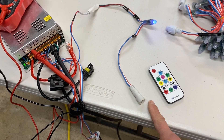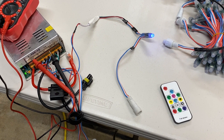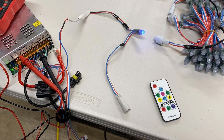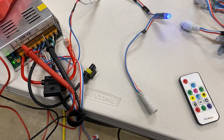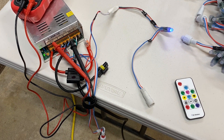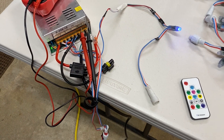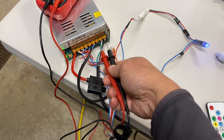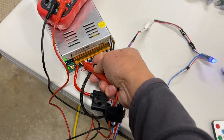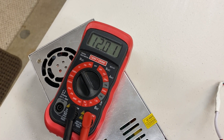Going to the end of a pigtail here. This little tester has 7 steps, simulating anywhere between 0 and 100%. Those steps are 14, 28, 43%, rounding, 57, 71, 85, and 100%. I'll show a table in a few minutes looking at how many pixels we can safely attach at different brightness levels so we don't blow a 5-amp fuse. I do have a fuse in-line at 5 amps. For this test, I personally recommend running 12-volt pixels at 11.2 volts, but for baseline test purposes I have this set at exactly 12 volts.